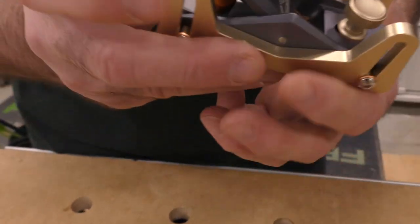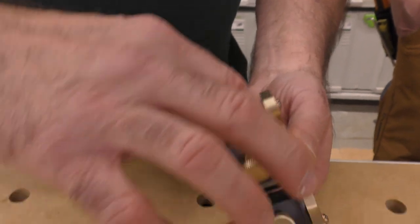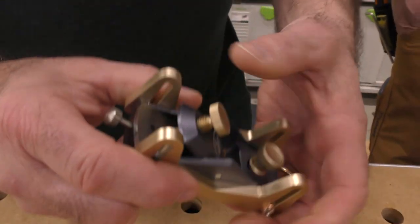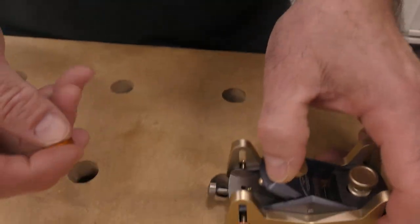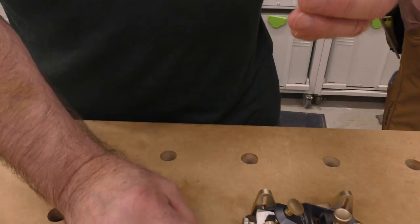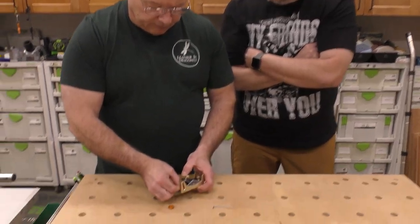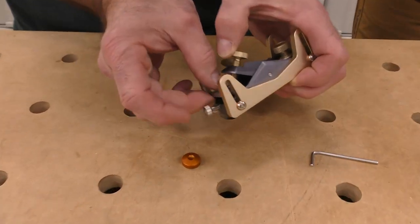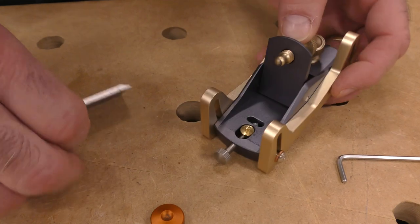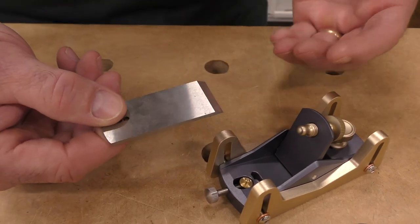When I release this, it allows you to adjust your blade to and fro. But this part here — check this out — this is a little magnet. The angle of this adjuster or tensioner goes right into this little detent, and it actually actuates perfectly to tension the blade down. Effortlessly. Here's the blade — it's got two notches on it and it goes right here. This is a Norris style adjuster. When I set this up, I'll put it right here and adjust it. This is bevel up, which all block planes are.